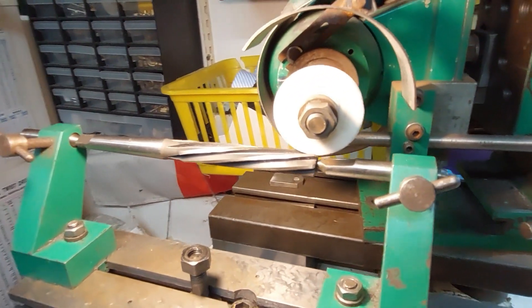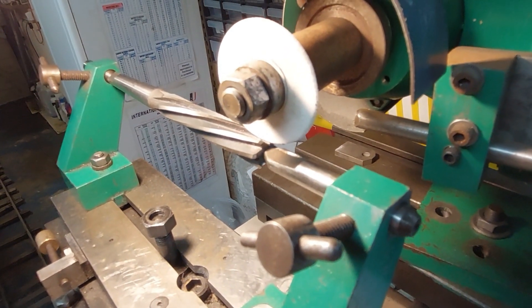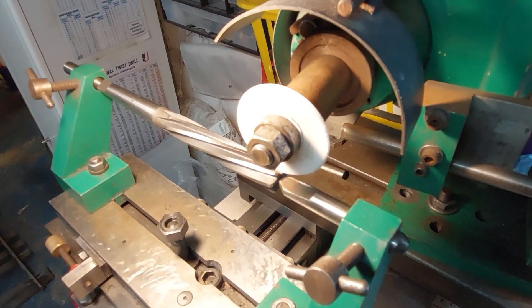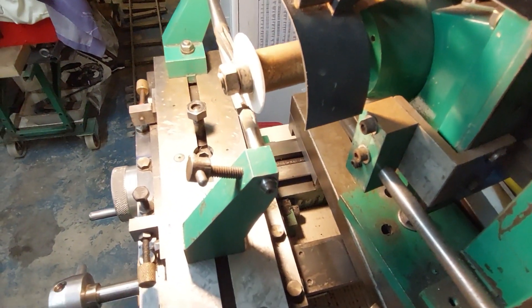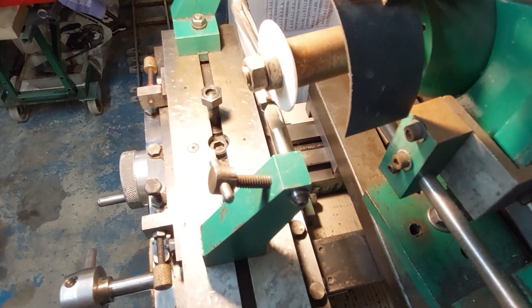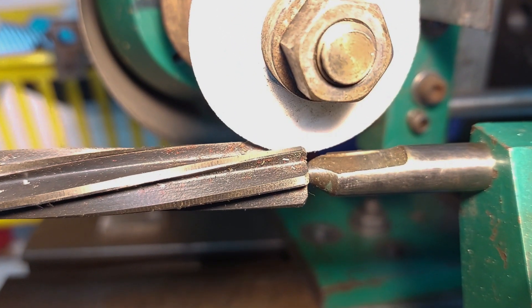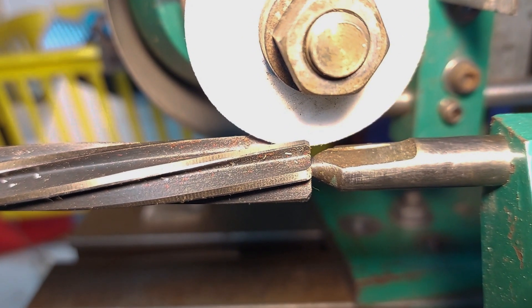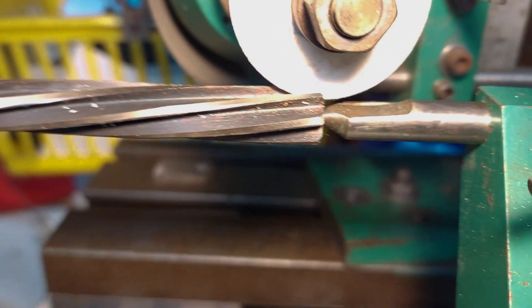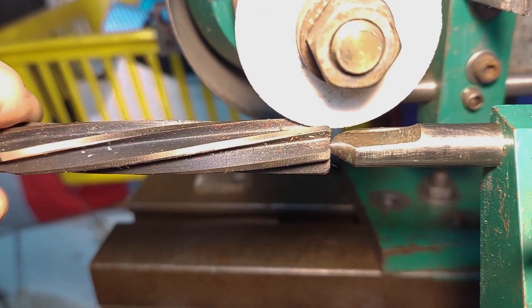This video shows my setup for grinding the flutes of reamers. I had one or two reamers with some tiny little nicks on the OD on the edge of the land, and the result of these tiny little nicks is that the bore when reamed shows a series of concentric scores. So what I've decided to do is grind the reamer flutes and polish out these tiny little nicks. This particular reamer is a mill type - it's been milled and left in the rough state.